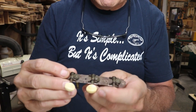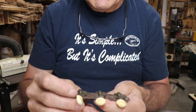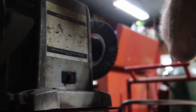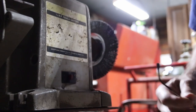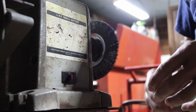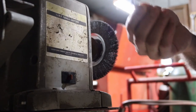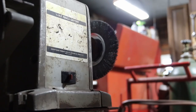I'm going to take them completely apart and polish all the metal up. Over here on the dark side is the wire wheel. I just want to tell you that anytime you're using a wire wheel, never use it without wearing safety glasses. This thing throws wires continually and they could easily end up in your eye — they will end up in your skin. I've had them stick in my arm already. It is a dangerous piece of machinery in the shop and you should respect it. This can also grab your part and throw it on the ground. It's all about the angle that you touch it in. I'll probably end up dropping at least one or two pieces by the time we're done.